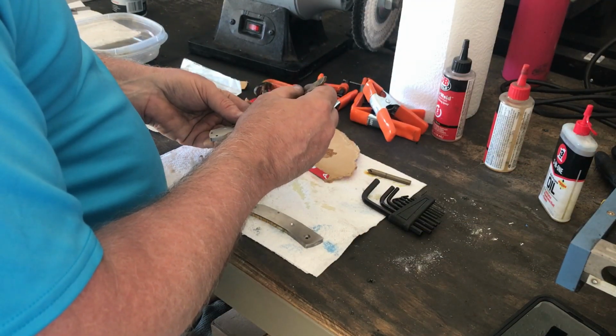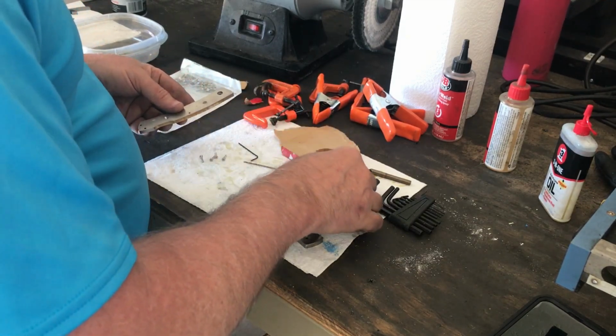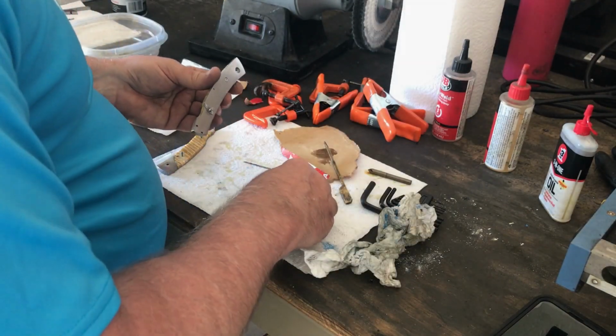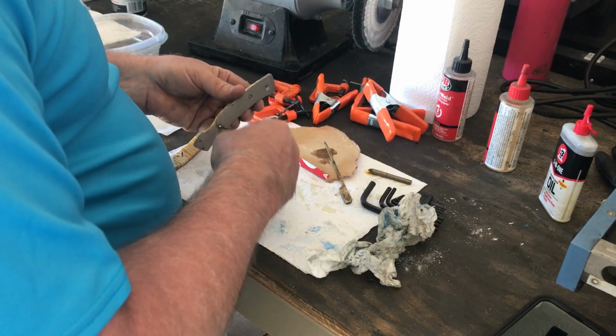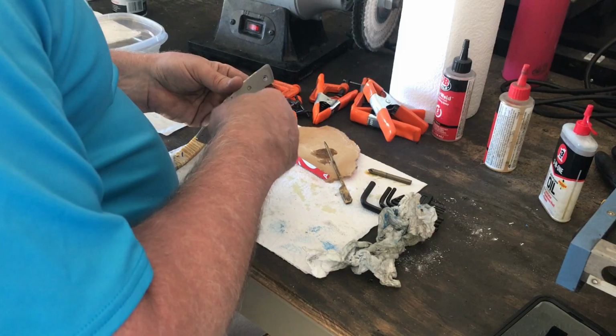After attaching the Mammoth Molar to the stainless steel liners with epoxy, I've drilled out holes and tapped them to accept a 2-56 stainless steel screw. Here I'm attaching the screws using epoxy to set them in place so they won't back out. After the epoxy sets up, I'll surface grind the screws down flush with the scales.